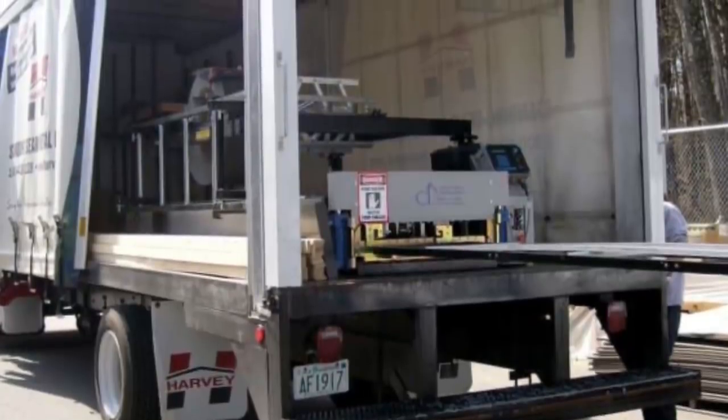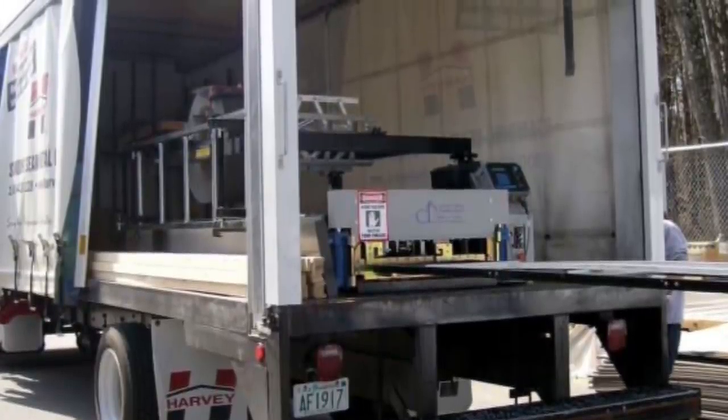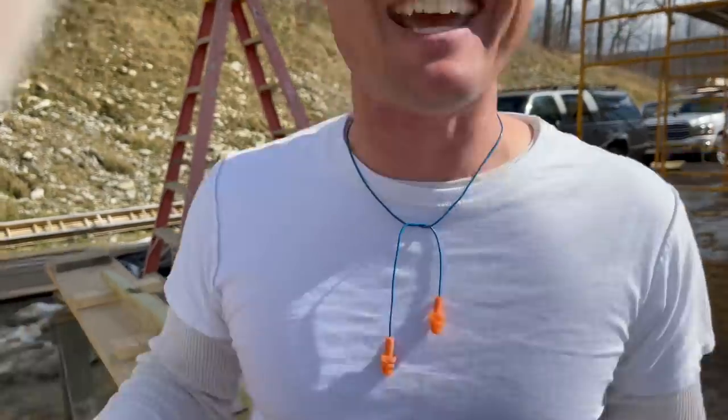They need to know all these measurements ahead of time so that when they send the truck here that has the giant trailer on it, with the giant forming machine that rolls flat metal into roofing panels, they also bring all the pre-made trims that I have written down on this list and know the exact numbers of every length of panel, so that the operator of that machine can start fabricating these panels on the spot when he gets here, and not have to wait for me to climb around and start yelling numbers off the roof like Jason.